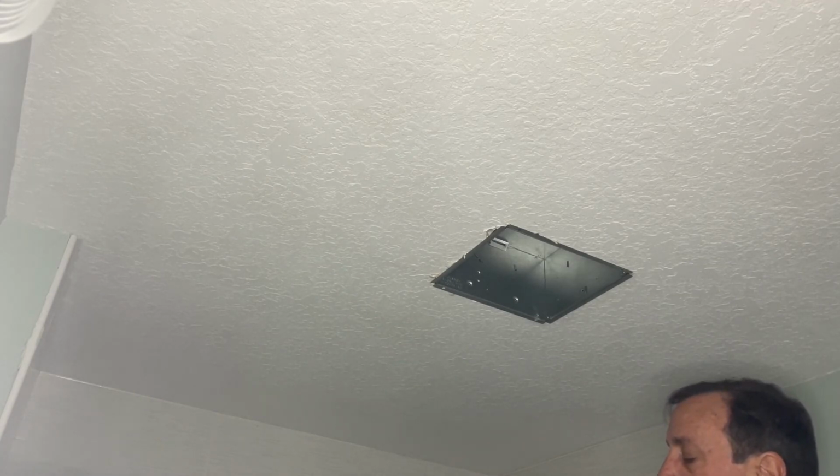And I just finished the wiring, which this fan that I'm putting in has a light as well. So you're gonna have two pairs of wires. You put green with green, and that's gonna be your ground. Then black with black, and that also goes with the black. And then white with white. Then you just wire nut them all. I like to put a piece of tape on it, and then you shove that in there. So while I'm doing all that, I'm gonna pause, and then we'll be right back.